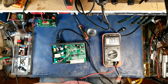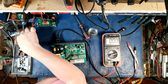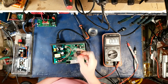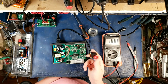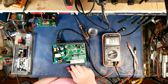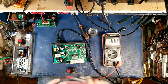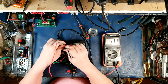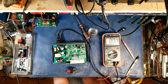So, you know, you could do a couple of things here. You could actually just stick one of these on the back of this if you really want it to be fancy, and you can just tie it directly into these leads, and you could actually just use this as a UPS as well. You could actually tie your batteries directly into this and charge it off this little tiny PSU. Yes, you could absolutely do that, and that would probably work, because look at the voltage. We're running at about 53.8 volts, and if I get my calculator one more time...